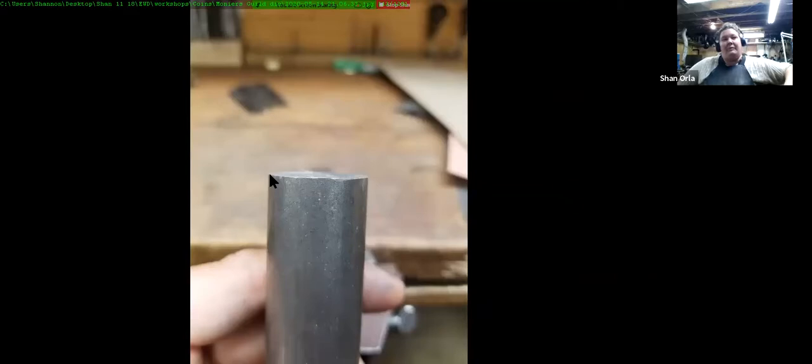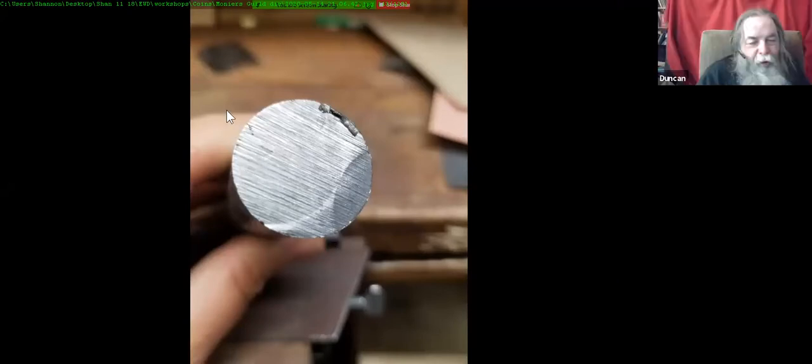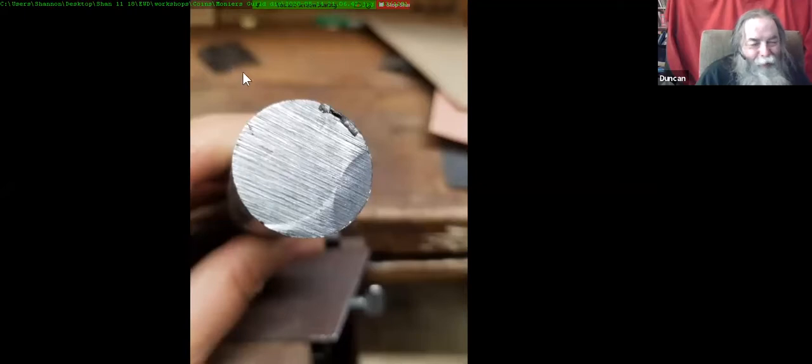You'll want to find places where you can buy 1018 steel. I get it from Metal Supermarkets here in Ontario. You can see they're using some sort of machine to slice the rod — basically a bit power bandsaw. That's where you get these weird crescent shapes. It's an artifact of some harmonics going through the blade.